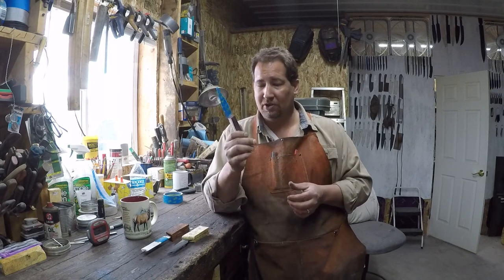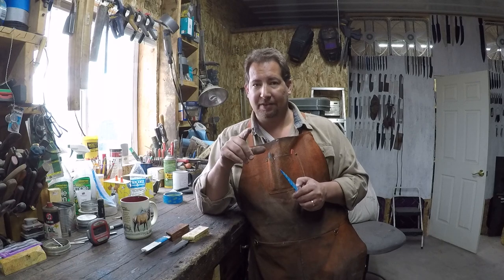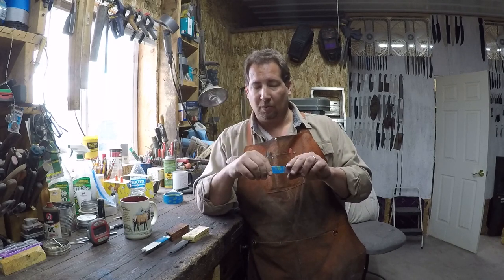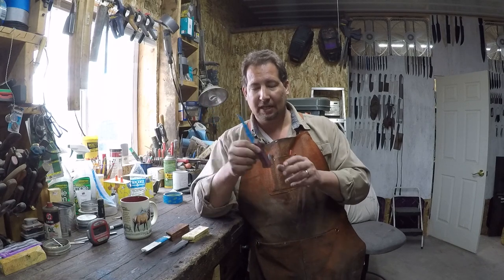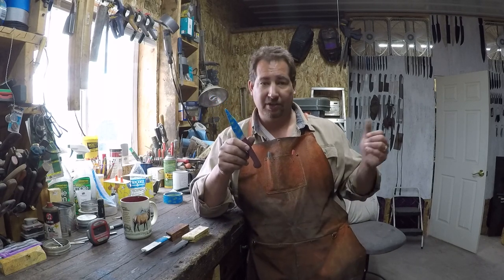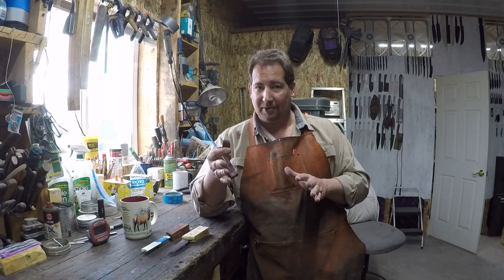Even if you grind every day, unless you're grinding the same knife every day, like just that paring knife and just that style, then every time you switch to a new pattern or a new class of knife, that first one's always just a little bit wonky because you're kind of getting used to it, right? Big thing there is using a micrometer when you're grinding, which I suppose we're getting off on the handle material section, but just real quick, using a micrometer when you're grinding, because let's say you're working on 18 inch choppers one day, right? And then the next day you go to paring knives, all right? If you don't have a micrometer when you're grinding, your paring knives will be a thick, chunky beast of a paring knife, because you're used to grinding choppers the day before. And if you grind a chopper to the right geometry and it looks good, the next day your eye will think, okay, that looks good.